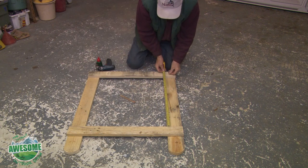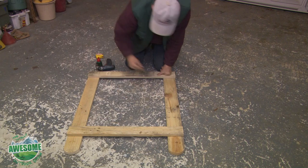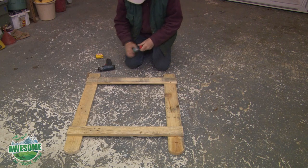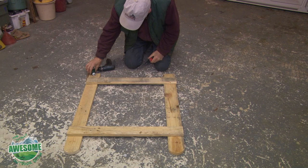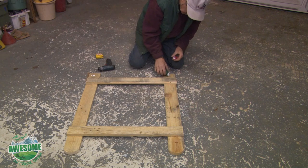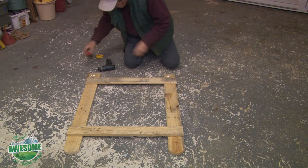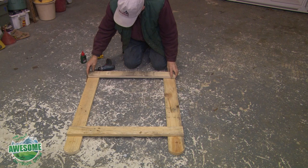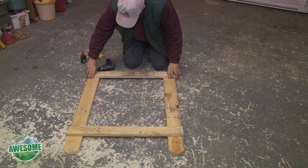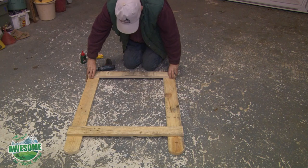So you can do it, millimetres might be a bit better than inches, but easier to see. And what I'm going to do is, now I've got that level at the bottom, I'm just going to mark the bottom, turn it over. Just going to put a dab of glue. Now, you could nail this. I do know that people do nail them, but I've always felt with something that's movable, probably it's all right, the picket fence, because it's standing in one position, but the gate is always going to get moved. So I'm going to put a little dab of glue in the centre there. This regular wood adhesive to help bind it together. And should the movement of the gate being open and closed actually loosen it a bit, you know, the nails, then the screws and the wood will hold it all together.